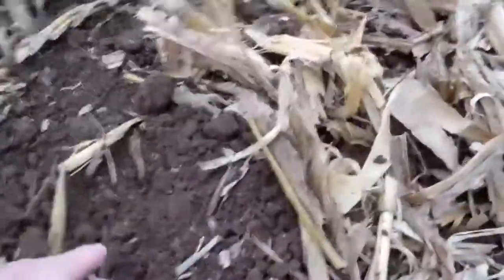I'll get you to another area here. This is really kind of what it looks like. If you look down in here, this dirt is really mellow and you can just dig down into the seedbed area. We're running this vertical tiller at about an inch and a half depth and we pull at about seven miles an hour. What that does for us on our bean ground is it gives us good stalk-to-soil contact for decomposition — these new varieties have stalks that are harder to break up. So we've gone to this to try to reduce some trash in the spring as we come through and no-till our beans in, and the added benefit is that our seedbed is nice and mellow and fully prepped.